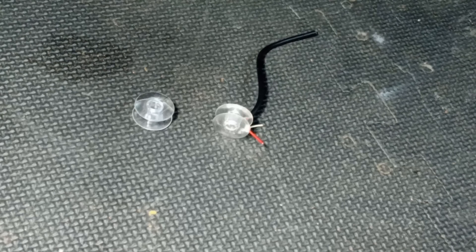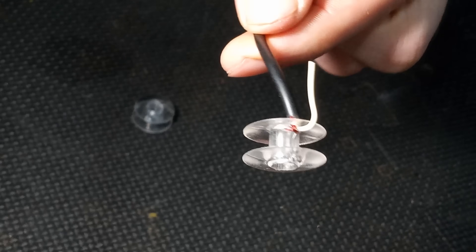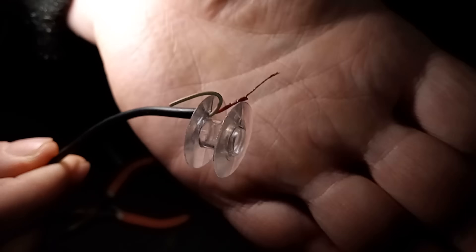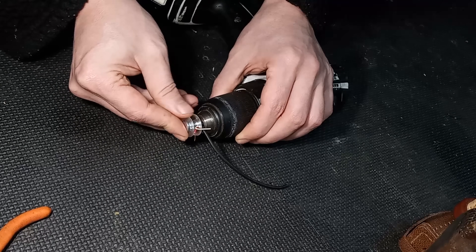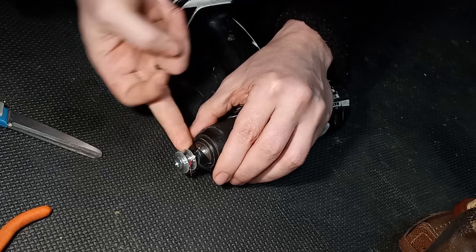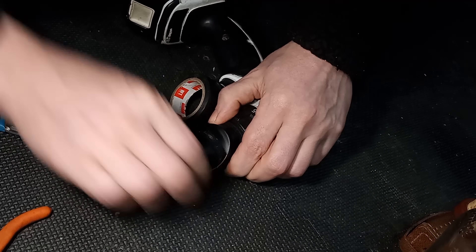These round clear things are just normal sewing machine bobbins — by design they happen to be perfect for building single-string guitar pickups. Conveniently, there's also an automatic winder for them on top of just about every sewing machine made. That two-element wire is nothing more than an old USB power cord. First thing to do is strip back the end of the positive lead; the negative lead can be left alone for later. I took a cap head bolt, pressed it to the center of the bobbin, then pressed it tightly into a drill chuck. Then I took a tool and creased that little white ground wire tightly around the corner of the bobbin and used small pieces of tape to hold it out of the way. I also used electrical tape to hold the pickup lead to the chuck so it wouldn't fly around and break the pickup wire later.